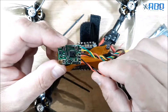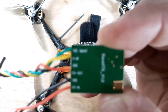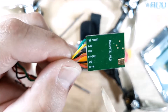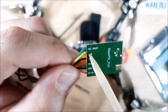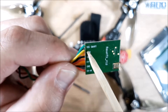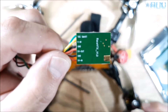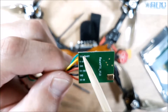So basically, looking at this VTX: you have your power going in, and if you notice, that's five volt in. This VTX, like a lot of others, takes five volt in — you cannot run battery voltage to it, you have to run it off a five volt BEC. Then you have your ground, and then you can do five volt out and ground, which is video in to your camera. These three would power your camera and receive information from it. In this build I'm not using the VTX to power my camera — I'm using a 10 volt BEC off of the T-Motor 55 amp Pro 2 ESC.